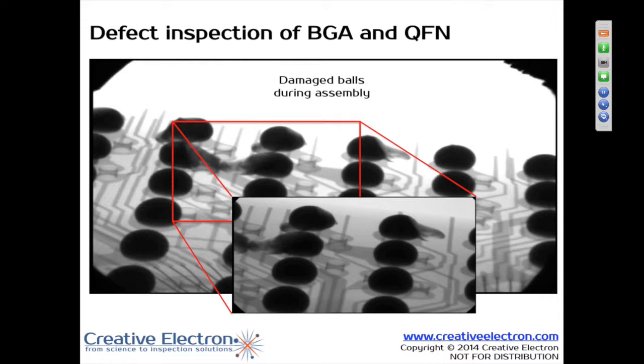It looks like it's not a mechanical issue because mechanical issues tend to have very hard edges — they don't have the nice, smooth edges that you're seeing. In the blown-up image on the top right, you see a very nice, smooth transition. That's a nice solder fillet if you were looking at a QFN, but for a BGA, that's not a very good solder fillet. If it was a mechanical problem and the component was compromised prior to putting it on the board, you would see rough, angular, heavy, straight edges — and you really don't see any of those. Those are all nice and rounded, so that would probably indicate you've got a solder paste application problem.